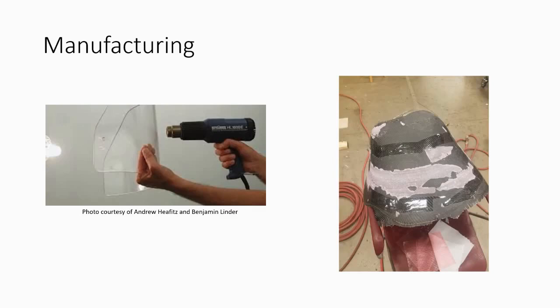However, after finalizing the fairing, we found that the vacuum former available to the team was too small to create the windshield that we would need. So with the other 2 options eliminated, the team chose to thermoform the windshield over a mold using 2 heat guns. The mold shown on the right here was used, and the process is roughly shown on the left.